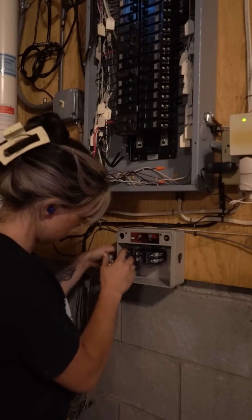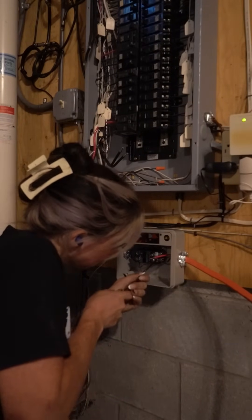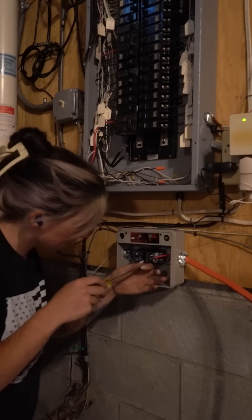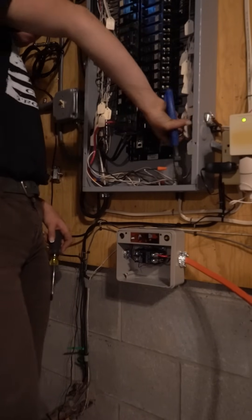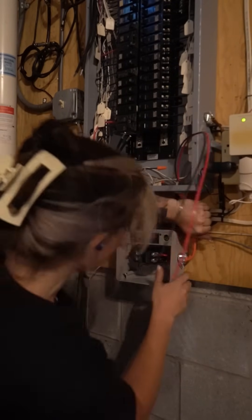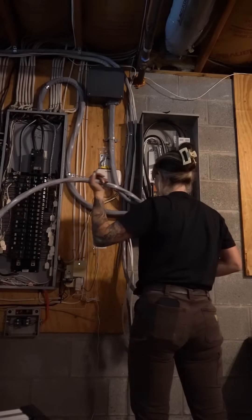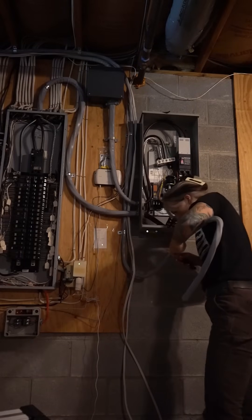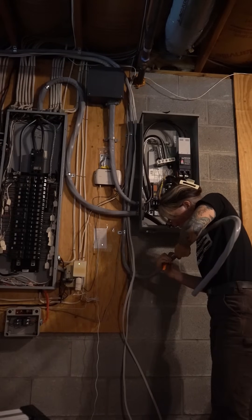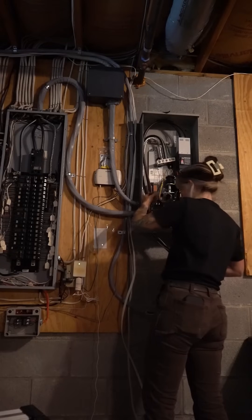For the load shed module, you don't need a neutral or ground — you just need to connect the hots. You need one coming into the line side from the breaker into the load shed module, and then another 10-gauge wire coming out of the load shed module going to the load, which is the AC unit. It's a little hard to get 10-gauge wire up into that button connector so it's a bit crinkled, but I straightened it out. I'm cutting the wire back to install it into the bottom two lugs and get the generator syncing with the transfer switch.